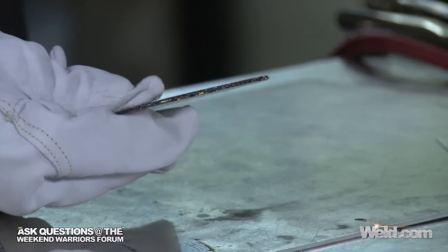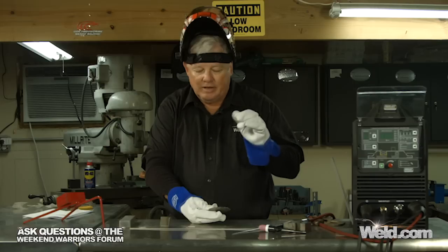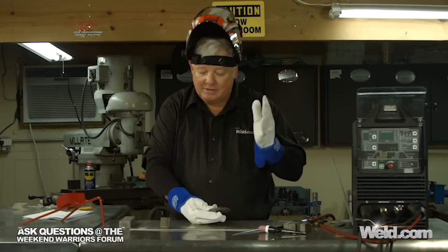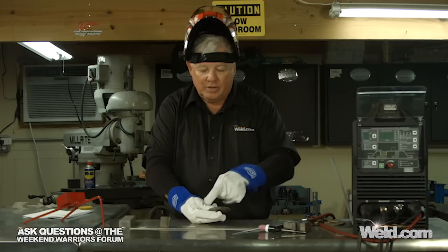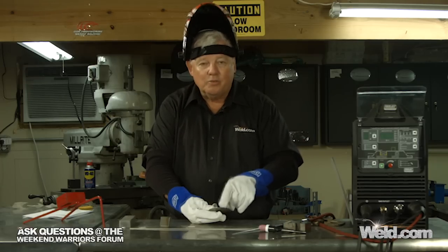So I did the screen welding. The screen is only 6/1000. So I was welding at 6 to 7 amps. The machine stayed stable all the way through. Anyway, I'll end up finishing this up and show you in one of my later programs what this looks like.